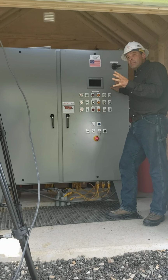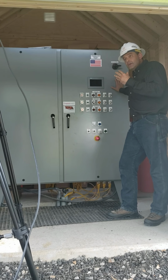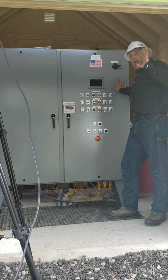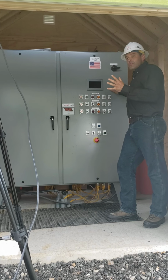Having accomplished that, if I was going to energize one of our circuits, I would first begin by closing the cutouts, feeding the pole-mounted transformers. After we closed those transformers, I would start to go through the startup sequence.